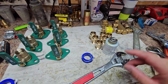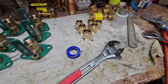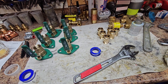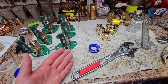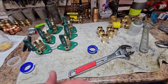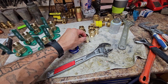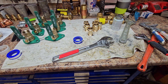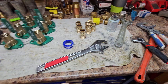I'm also in the process of getting all my parts together and all of the fittings that are required — I have shutoff valves for all the circulators and all my adapters. This customer also wanted everything to be pro press. What I like to do during my builds is give the customer the option to go with whether they'd like to sweat their connections together, whether they'd like to use PEX, or whether they'd like to use pro press. This customer opted for the press fittings. We can really build these any way you want, and if you'd like an estimate, just reach out — I'll put my email and contact info below.